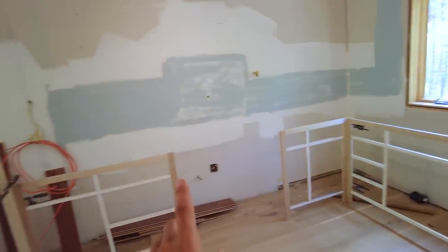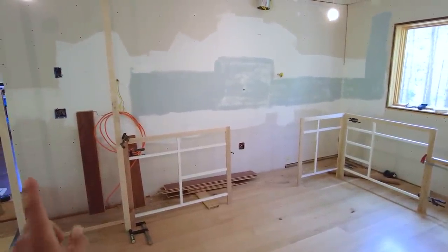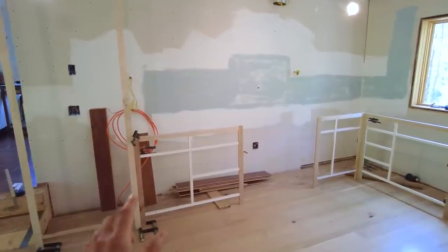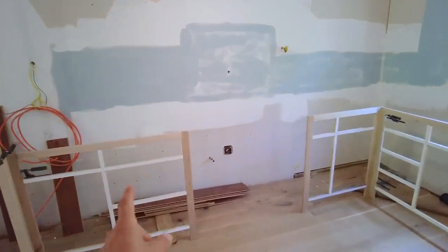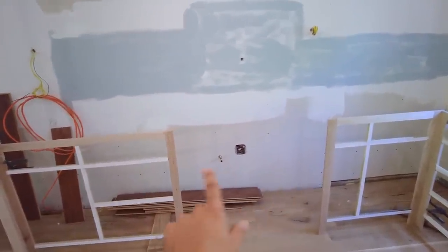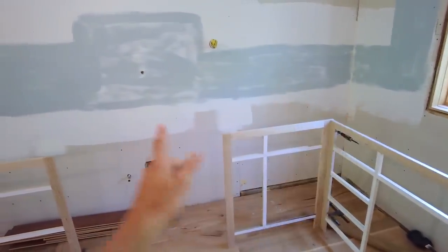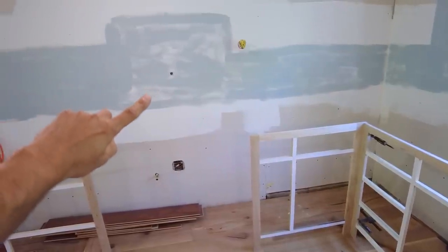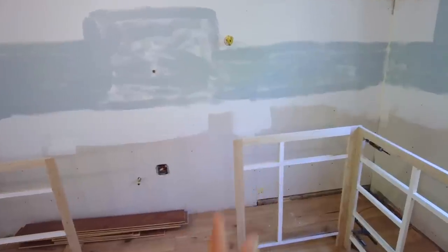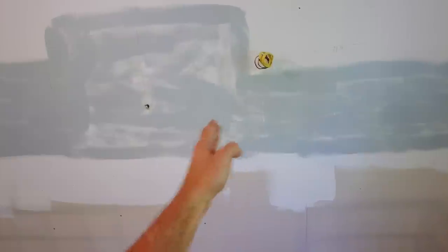On this wall, I had one issue that I knew about this morning when I built this frame for this unit. I had planned in my layout for this unit to be a 36 inch. It actually used to be 34, so I have 2 inches of difference that I can put into this bank of drawers, and that'll bring this to my 36 inch opening that I need for the range. This area up to this point is kind of fixed because it's based off of the center point of the range, which is the pot filler location there. So this needs to be exactly where it needs to go. The end of this cabinet is exactly 18 inches off the center point right there.